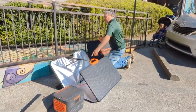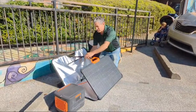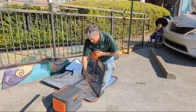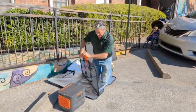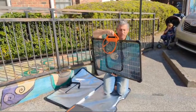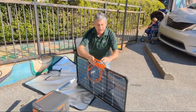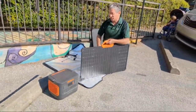Let me take this one apart. Notice this strap here that comes so that you can put your reflector and it hangs at the right angle to reflect sunlight onto the other side of the bifacial panel. So that is really cool. The fact that it has this stand on it, the fact that it comes in a carrying case, they really thought of everything here. So I'm just going to put that down like this, pull this in here. But yes, bifacial solar panels are the most efficient panels today because both sides will collect sunlight. The Germans have shown now that if you were to put them, instead of facing south, facing the sun, if you put it up vertically and you get the eastern sun coming in the morning and the western sun in the day, you actually get more power in some situations than putting the entire single face facing the sun. Although by putting the reflector on the other side, you get the best of both worlds.